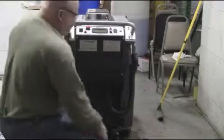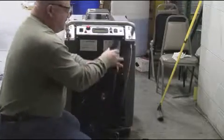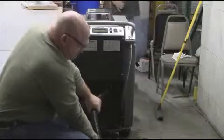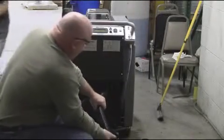At the end of your cleaning shift, it is important to service your Magnum auto scrubber in an area that is approved for draining. Your first step in the maintenance of your auto scrubber is to drain your recovery tank and solution tank as demonstrated here.